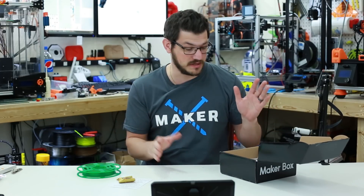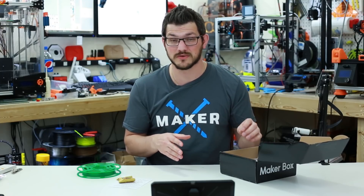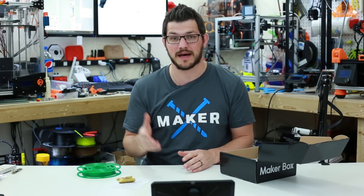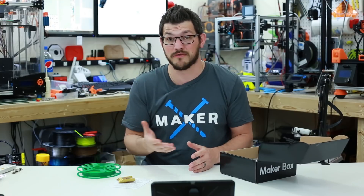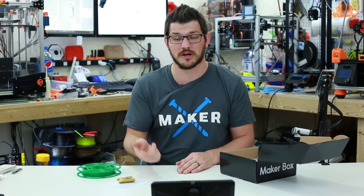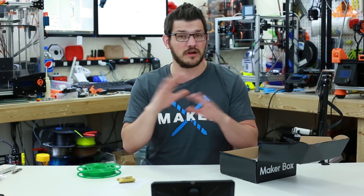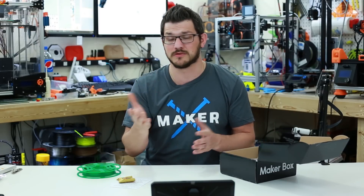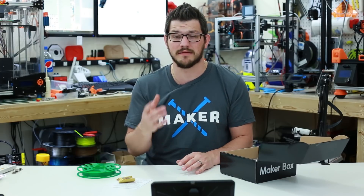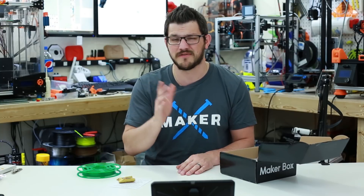This whole box seems to be exotic — almost everything in it requires an all-metal hot end or a hardened nozzle. I get all my hardened nozzles from Micro Swiss. They're an excellent company, I've been buying their nozzles for two years and I've never yet had to replace one. Every new machine pretty much automatically gets one. Also check out an E3D all-metal hot end if you're going to print anything high temperature, or at least buy their all-metal throat and throw it in your clone — it's about a $15 purchase.